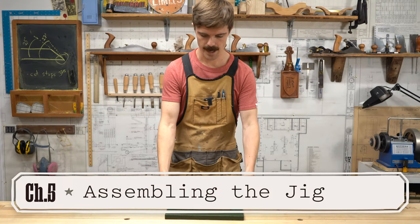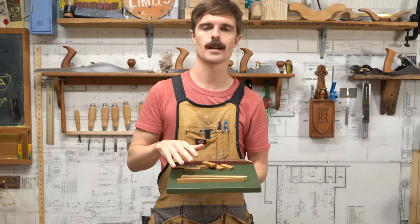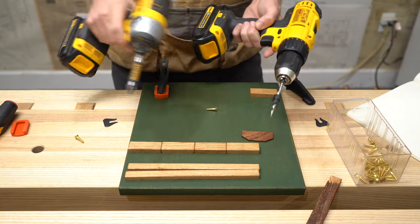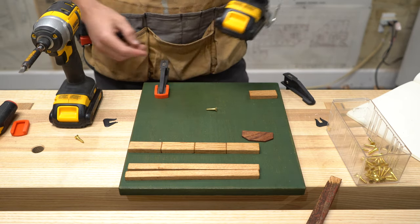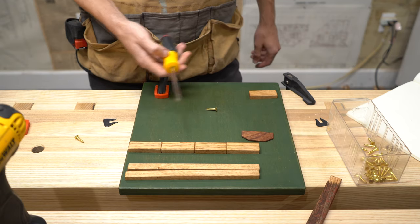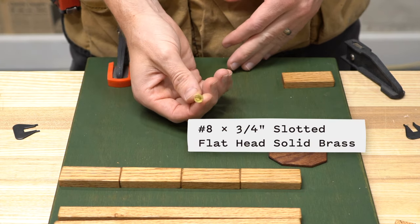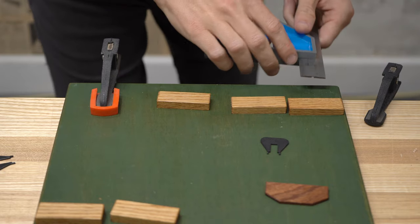We are so close to being done. All parts are cut and finished — the last step is to attach everything to the base. A couple quick notes on tools and hardware: I have two drills — one with a countersink bit to drill holes in each stop, and one to drive the screws. I typically finish off the screws by hand so I don't strip them. The hardware is brass number 8 slotted screws, three quarter inches long, from a company called Fasteneer.